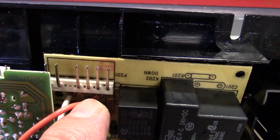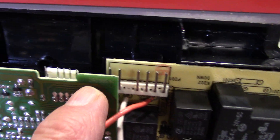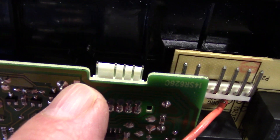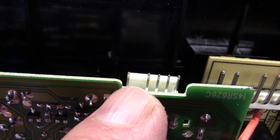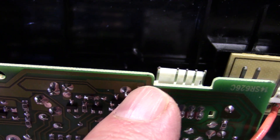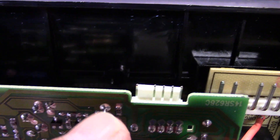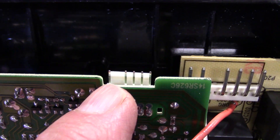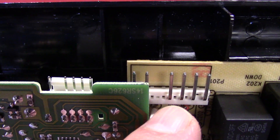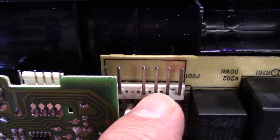The wiring harness on the power board has four prongs on one side and one single prong on the other end. There is also a smaller wiring harness with four prongs and one single. You pull those wires out — they just pull apart. When putting them back, it only goes one way. You line up the holes with the prongs — four on one side and one — so you can't mess this up.